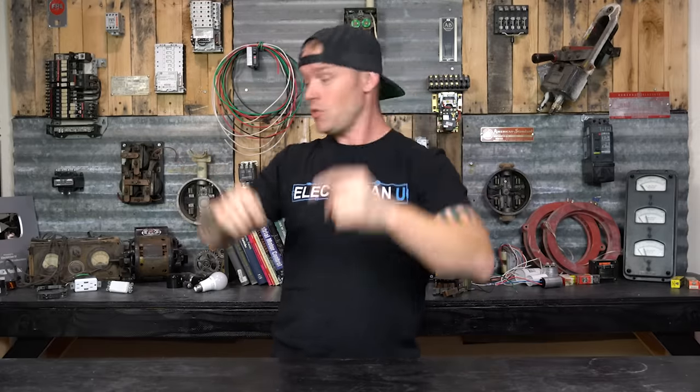That's really important to know because if you start landing wires in a panel one breaker at a time, everywhere you have B phase you're going to have 208 to ground. If you hook a vacuum cleaner rated at 120 volts and run 208 through it, you're going to fry it — same with TVs or anything not rated for 208 volts. This happens often; it's one of those things people don't know until they learn the hard way. Watch out for orange — it basically means danger, something's different here.